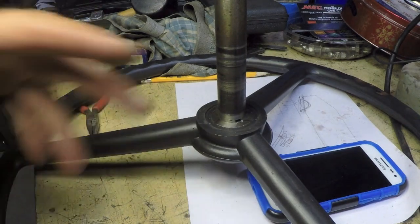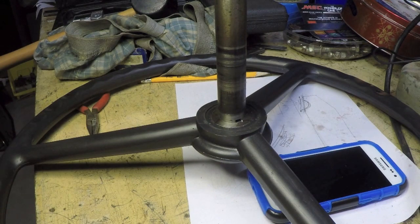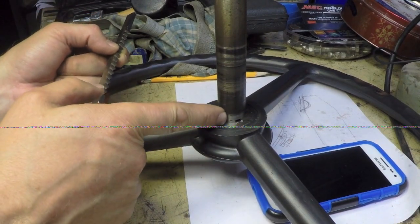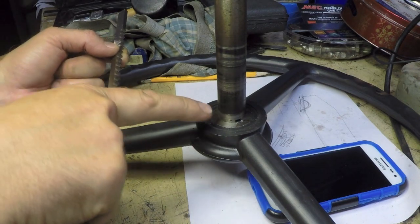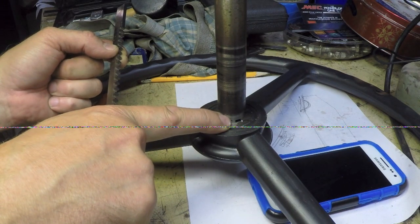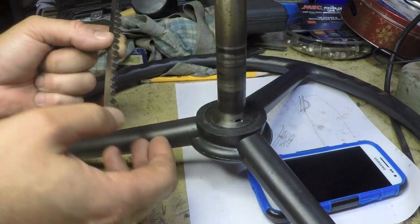All right, so I didn't record it because I didn't want to bore you with a lot more video and make this any longer, but let me just show you how I ended up doing it. After I took the other 10 thousandths depth out of that hole and it still wasn't going to work, I decided that the way to go about this was to use the broach and try and fix that slot so that slot was more uniform depth all along the length of the bore.